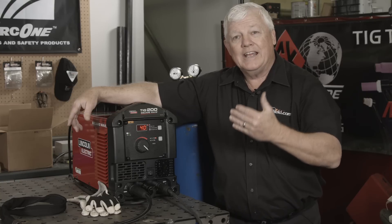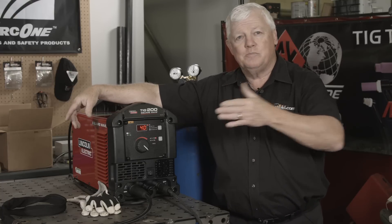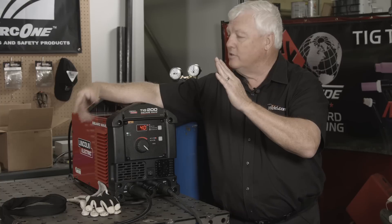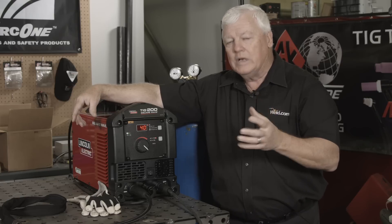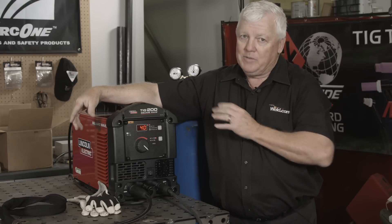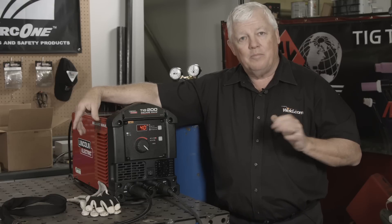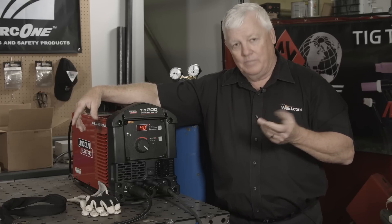The machine is rated to start at 10 amps. What does that really mean? Some people say their 10 is better than others. The 10 amps means you're going to get an immediate spike — it's not going to be 10. It's going to jump up to some given value for a short period of time and then come back down to stabilize. That's what they do to stabilize the arc start. So let's see how good it is. Remember, it's a hobby machine. My expectation is that for the $1,395 price tag, if I get a decent start, I'll be happy with it. Let me get my gear on, get the sample set up, and I'll do a demo.